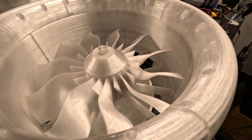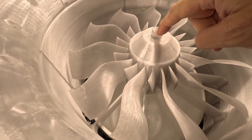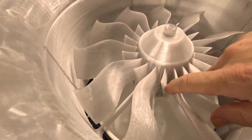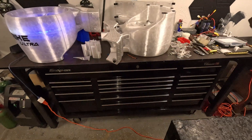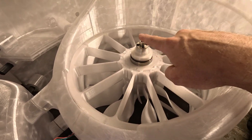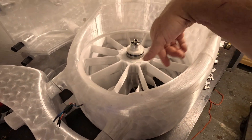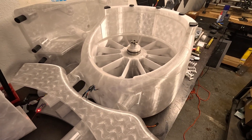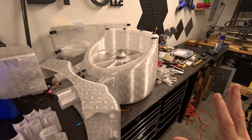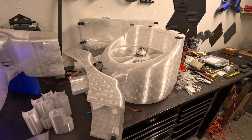The idea is I would love ultimately to CNC this stuff out of 7075 aluminum, which includes the blade, the hub itself, the center shaft — which would actually disappear in the aluminum version — and then on the bottom side you have the rest of the shaft, the collet right here, the main stator hub. I want to alloy that. The rest of this there's no reason why it can't be 3D printed or carbon fiber — that's what I love about this amalgamation of materials.